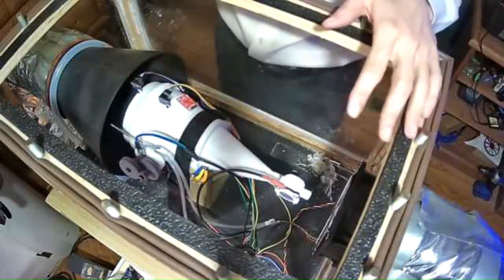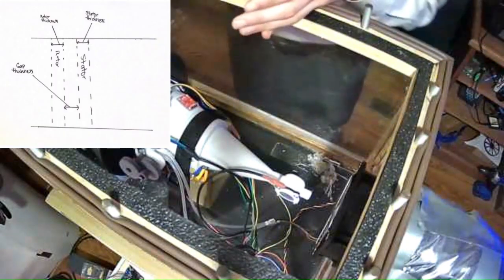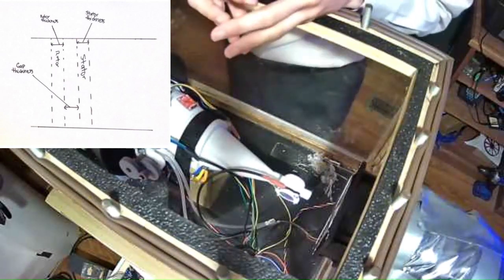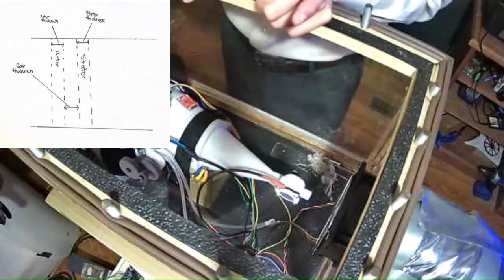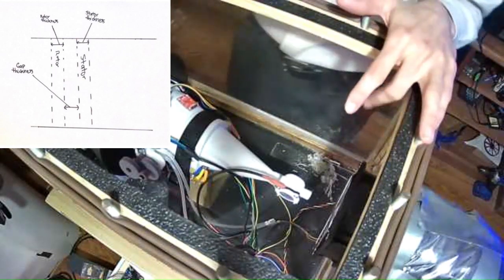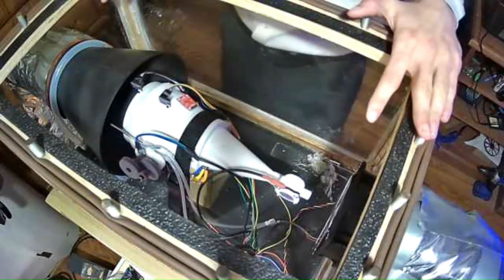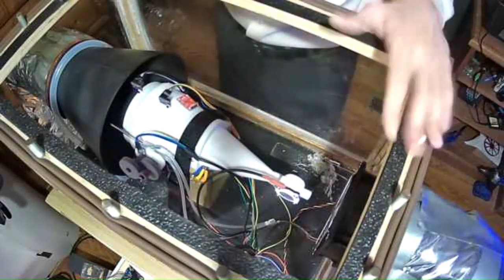However, I'm looking at some more upgrades. I've already thought about this and built it into the design. I'll put it up right here on the screen: there is a rotor and a stator. There are the thicknesses of the stator and rotor, and there's a gap in between them. I'm going to keep the thicknesses the same. I have distances to move the stator and rotor against each other, and I can also make them thicker. That gives me some flexibility on the variables for the design of the rotor, not just the geometry, such as twist rate, the angle of attack, the number of blades, the chord width, which will be the thickness of the rotor, and so on. I found 11 different variables so far for the rotors themselves that I can go into this design.